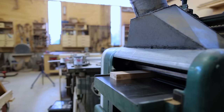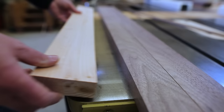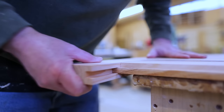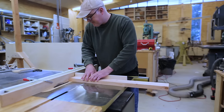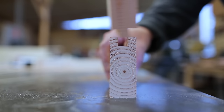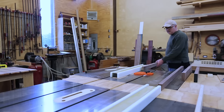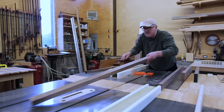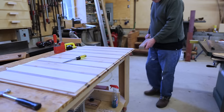While I was doing the walnut frame, I was also making a scrap piece exactly the same thickness to use for setting up the tongue and groove joint at the corners of the frame. The first thing was to cut the dado into the side piece and get it to fit over the tongue of the panel. Once I had that working, I set up the tenon on the end of the short frame piece to fit into that dado. It took some going back and forth and fiddling to get the fences set exactly right, but once the setup is done, the actual cutting goes really quickly.